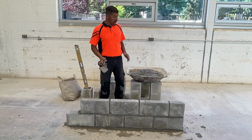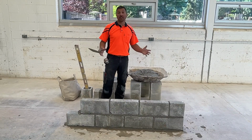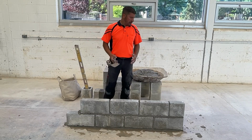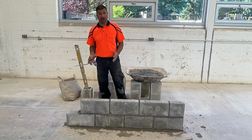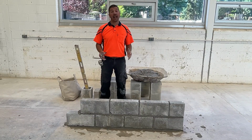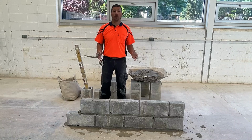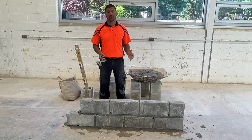If you want to, we can do a little make pretend. We can make pretend the rest of this lead is going to be built with hollow 4-inch block. Well, how's that going to change anything? Well, that's going to change our spreading technique. We can go back to face shell bedding. Hollow 4-inch block don't need to have solid bed joints. No reason. The block are hollow themselves. Same thing for the head joints. We can go back to sort of face shell bedding on the head joints like we did with 8-inch block.